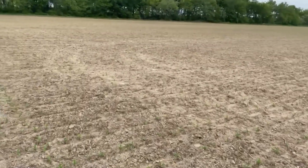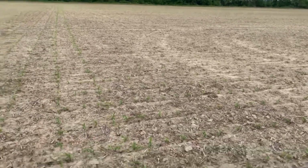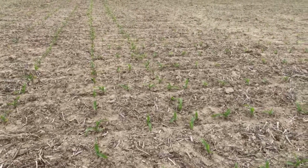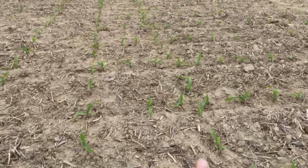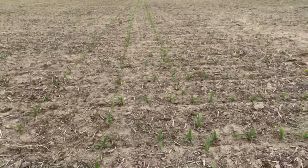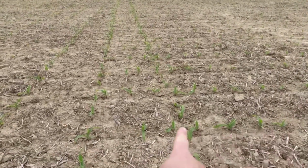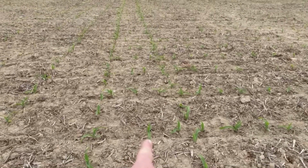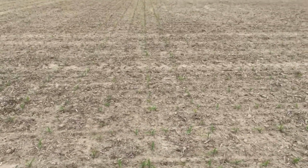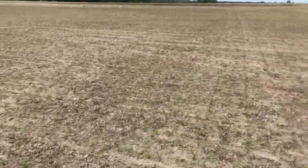Really good. You probably remember me talking about the row clutches that automatically turn off. We've got them set so that they'll lap one row typically. And so here's our end rows right here, and you'll see that's the last passive end rows right there, and the rows come in and they cut off about halfway between the first row or two. But overall, there's not much lap. I mean, there's no skipping. We don't want skips. And so those row clutches are really cool.